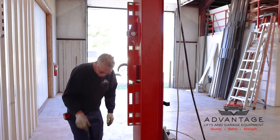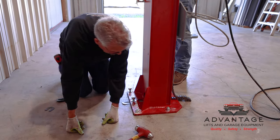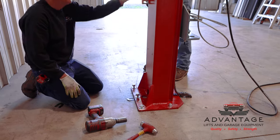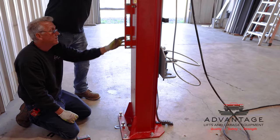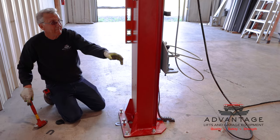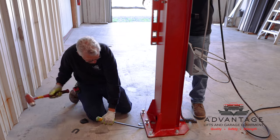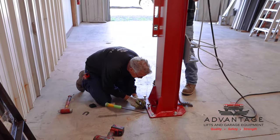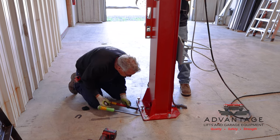So what I'm gonna try to do, since your shims are a 16th inch, we don't have any thinner, I'm gonna try and force one in here, loosen these up, and this is where you use the gun. Now, can you pull that that way, or maybe? Maybe not. Let's get that pry bar, that green handle pry bar up there on the workbench. I like this pry bar because it has a shank all the way through it. So when it's a tight fit, I can sort of use it like a wedge. There it is. See what that does.